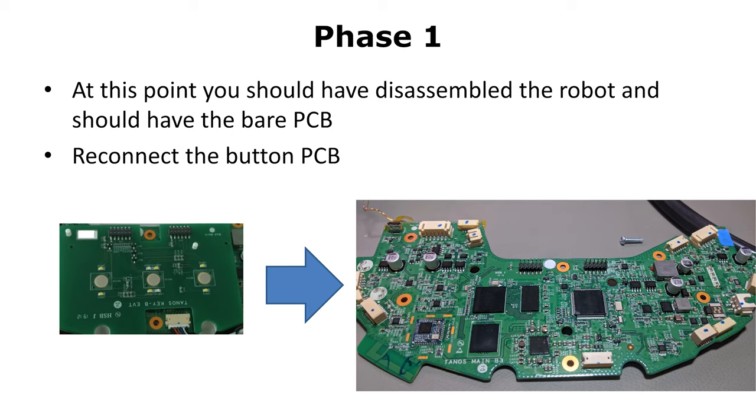Let's talk about our strategy for installing custom firmware on the vacuum cleaner. First, we need to build and download a custom firmware update with the dust builder. Then we upload this custom firmware update onto the vacuum cleaner over SCP. We use tar to unpack it and write it onto the System B partition. In the next step, we mount the System B partition and update the root password. System B is at this point ready to be loaded. We then need to mark System A as bad to prevent System A from being booted again in the next reboot. Then we reboot the vacuum cleaner and it will boot the new firmware.